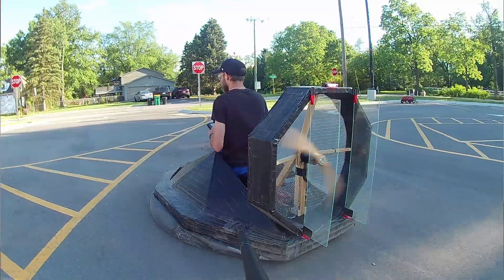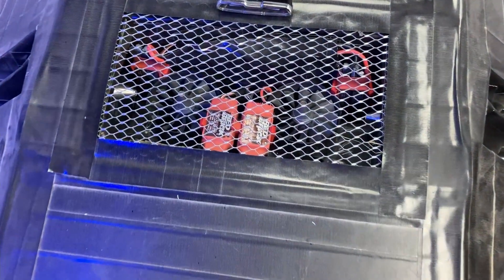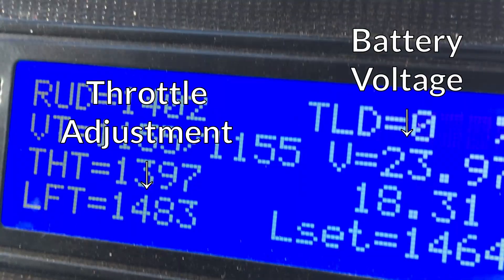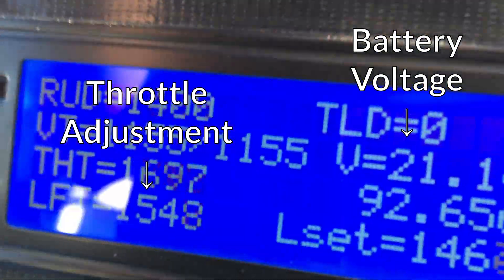When the reinflate command is given, we actually have a smart boost feature that throttles the motor above the running speed to quickly inflate the skirt, before dropping back down to the most battery-effective running level. The last thing to deal with is that with a battery-powered hovercraft, as the battery starts to drain, the lift motors go slower and slower as the voltage drops. So in order to have a smooth ride throughout the whole battery range, we've implemented voltage compensation, which proportionally increases the throttle when the voltage goes lower to maintain a constant motor RPM throughout the whole period.